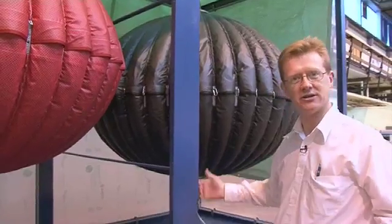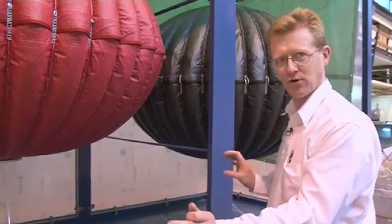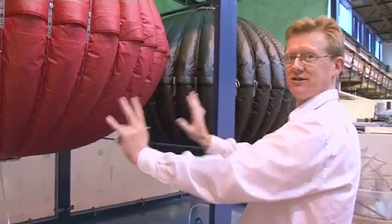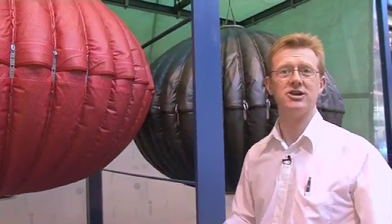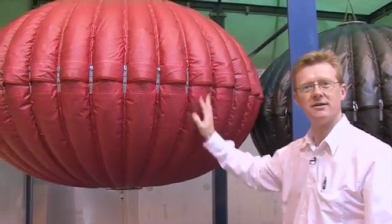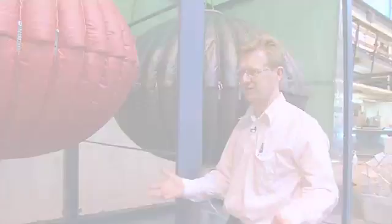These sides are yet to be mounted and we additionally need a little piece of external structure. Acrylic is quite expensive, so we bought acrylic that's economically reasonable at 25 millimeters thick, but it's actually not strong enough to withstand all that pressure over that area, so it needs an external support to stop the acrylic from coming out and letting water onto the laboratory floor. To save energy, we're going to cycle these bags so one is pressurized at any one time and the other is slack, with air cycling between the two bags. It uses a bit of energy, but for something that saves a lot of energy overall, that's justifiable.